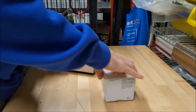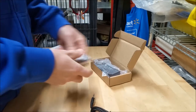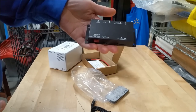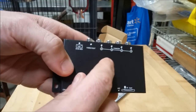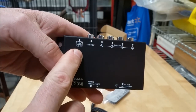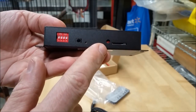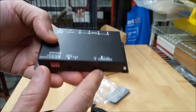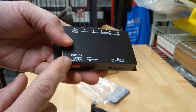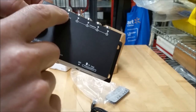These are the parts I was waiting on to finish the camera system. I'll show you this one first — these are about 35 to 40 bucks on either Amazon or eBay. Basically what it is, it's a little DVR box for cameras. You can see here you've got your four camera inputs and your video out, power input which is variable DC 9 to 36 volts, a remote control input, and a micro SD card slot for up to a 64 gigabyte card. The dip switches are for the mirror setting and a couple of other options.